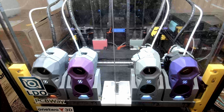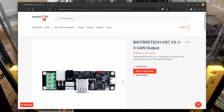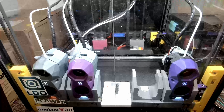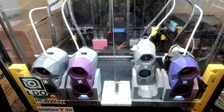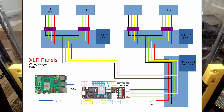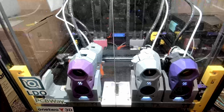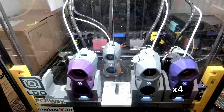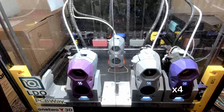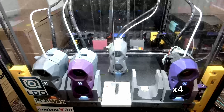In the context of multi tool heads, CAN tool head boards are very simple and cheap to set up in terms of hardware down in the basement. All you will need is to set up this 16-quid U2C board, which converts USB signal to CAN signal. From there it's just a matter of splitting the wires to however many tool heads you want. There should be a diagram on screen right now showing you how things are wired. One key highlight is that you can set up all your XLR panels at the same time you install the U2C board, since no additional electronics are required per connector. That means you can easily add more tool heads down the line without needing to access the basement again.